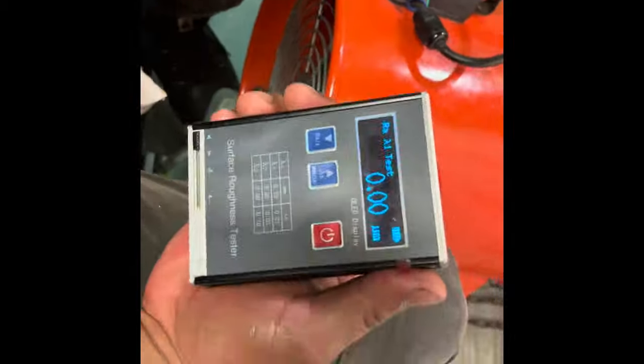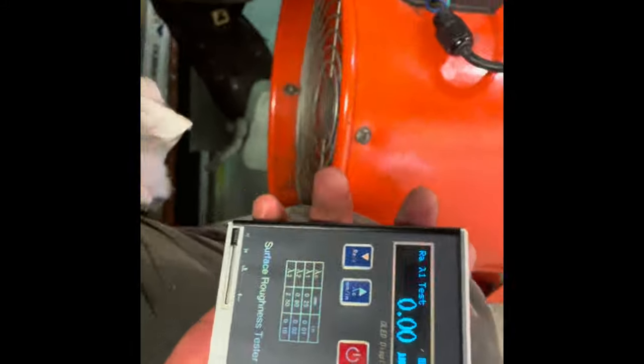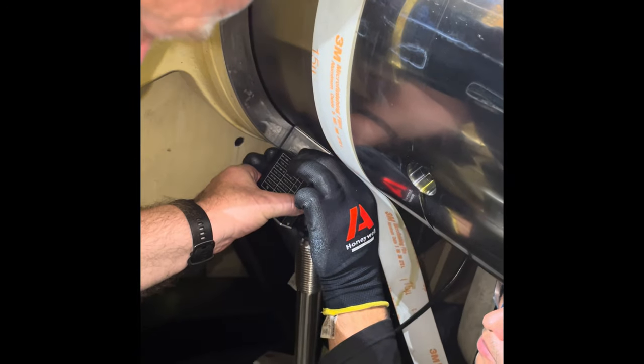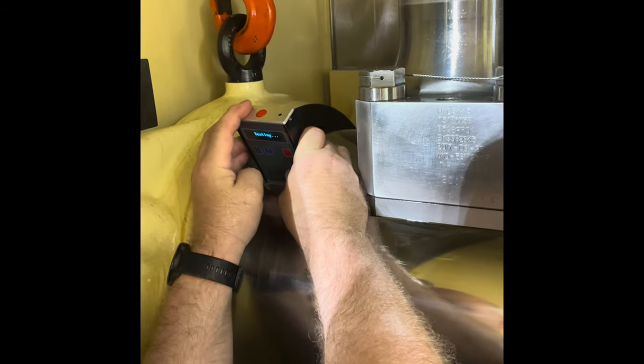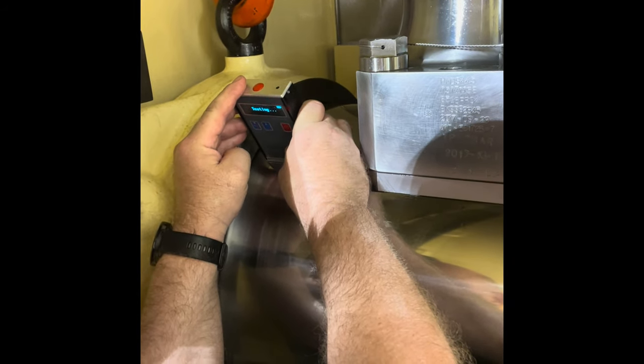Once the polishing is finished, you have to check the surface roughness using the surface roughness tester. Here I am checking the surface roughness around the pin. Where the scratches were, we have to check the roughness all over the pin so that it was evenly polished. I don't exactly know what the acceptable range is, but that service engineer told that 0.05 to 0.10 was accepted.